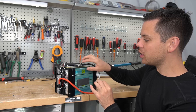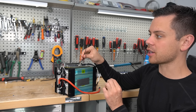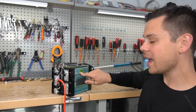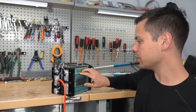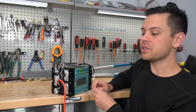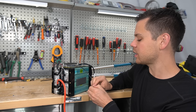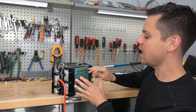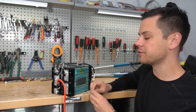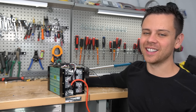This is still the cheapest one with low temp charging protection that works. We've tested lots of batteries that claim they had low temp charging protection but did not. This little temperature sensor is what differentiates this from all the others. Would I actually buy one of these? Probably not, but I know a lot of people will. If you have a very small system and don't need 400 amp hours at 12-volt nominal, then sure, you could buy one of these. But personally I would avoid this — I do not like inconsistent internal components. I hope you guys learned a lot and I will see you in the next video.